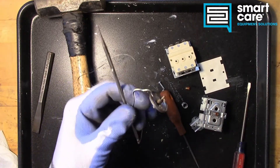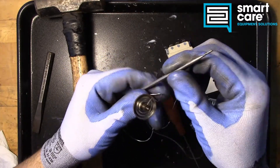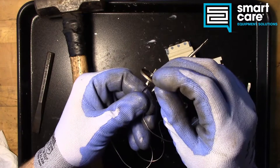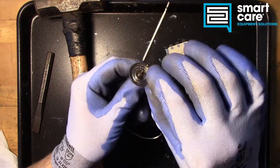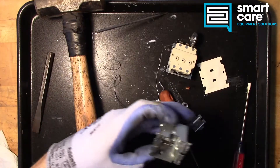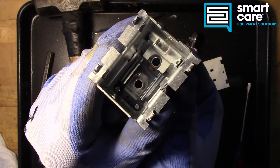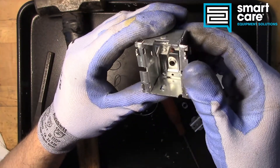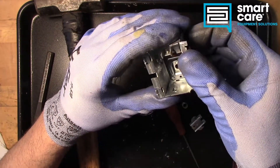Because of that, we know this will fail in the same ways that those B-J thermostats fail. If the cap tube becomes kinked or damaged, if the bulb becomes compromised — smashed or bent — or if the bellows develops any kind of leak. When that fluid expands, it has to travel all the way back through the cap tube and make the bellows put more pressure on the mechanism. The last part inside is just the reset mechanism — a little spring steel flex plate acting on a lever. Hopefully you're starting to recognize we're dealing with a lot of simple machines: levers, screws, all assembled in different ways to do specific activities.